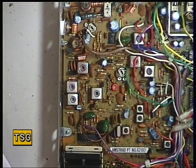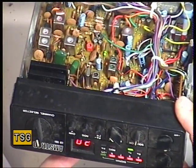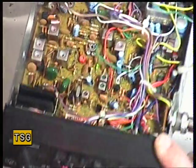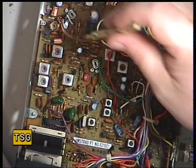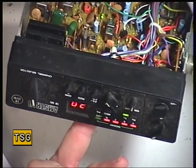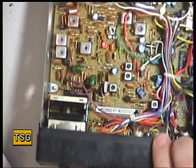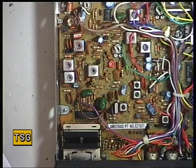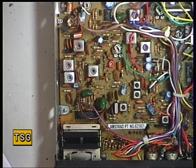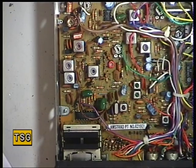Having set up the transmit power, we need to check the bar graph. It's showing a full range. Just making sure it's in correct alignment using RV1 — I'm just making it light the plus 30. Low power isn't adjustable on this model, but we'll check it. Low power is doing 0.3 of a watt; I'd prefer 0.4, but it isn't adjustable.